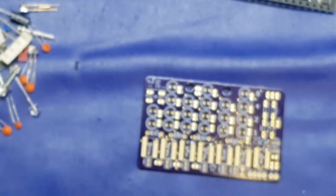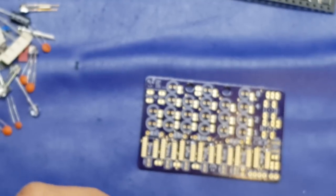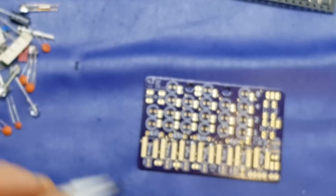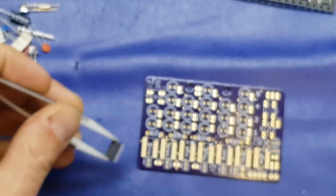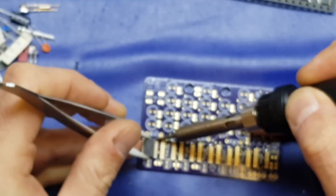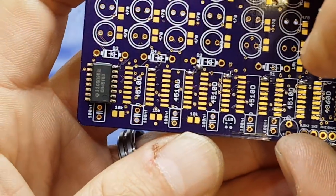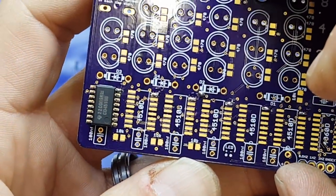So what we'll do is we'll lift those in one at a time. Now there's a couple of loose ICs in there, so I'll just make sure that this is the one I just dropped a moment ago. 4510, yeah. Dot is round, other way. And what we'll do is we'll just bring that in, reflow that bit that we just put on there a second ago, and have a look. Oh, not bad for a first attempt!